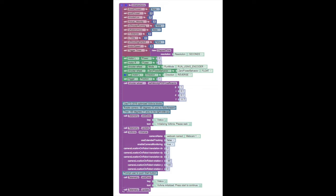At this point, we are going to dive into each of the functions that you saw in the code — the purple blocks with names like initializations or pause quickly. In the initializations function, we set up all the beginning values for our system. Basically, this says we haven't chosen a spot from which we are shooting accurately, we haven't set an actual velocity so the system shouldn't be running, we haven't set an X distance, we have no trigger set, and the motor speed is set to zero. There are some additional values here including what we use to drive, what we use for the PIDF values which you can look up in a separate guide, and the initializations for the Vuforia targeting system. All of these are vital for our setup. You can look at them individually with some of the resources published on the FIRST Global website.